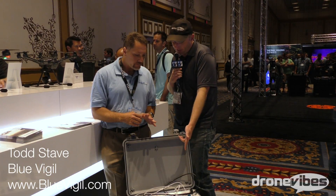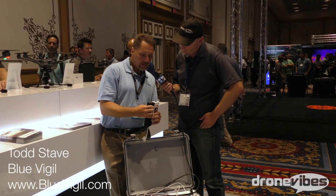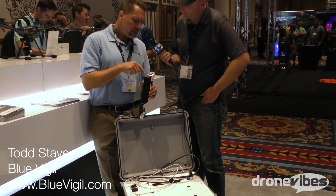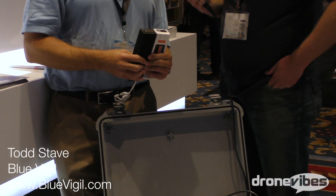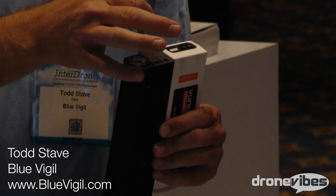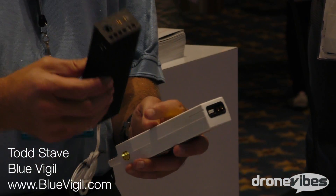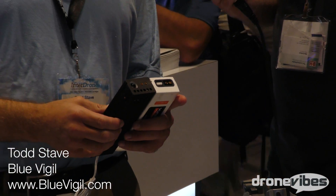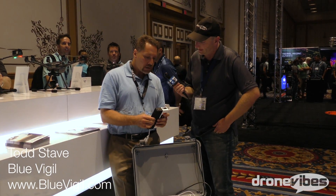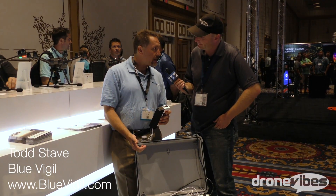I see there is an adapter here for the Typhoon. This is a unique adapter, but there's no reason that we couldn't have adapters for really any aircraft. This one is a little bit different in that the connectors are a little bit proprietary. But we have an adapter that we can plug right in here — we can strap this on to a 3DR Solo or anything else really that takes a voltage between 12 and 24 volts. We can plug it into where the battery used to be and it'll stay in the air indefinitely.